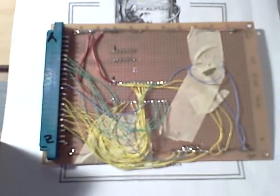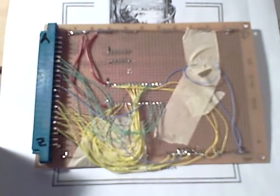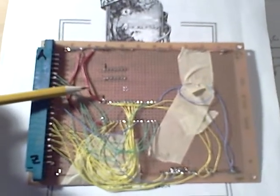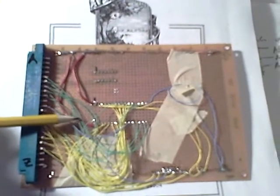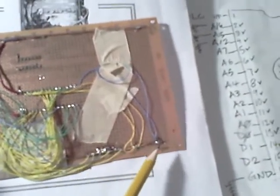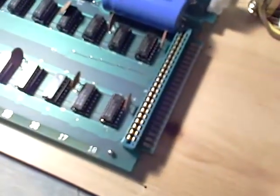On the back, the yellow lines are the address lines and the green lines are the data lines. The red is power. I actually did end up connecting VPP, which is pin 1 right here, and that's normally used to program the chip at a higher voltage, but I went ahead and connected it to 5 volts as well as VCC. The blue wires are ground — this is the ground rail, basically stripped copper wire. The power rail is up here. The cinch connector here is two rows, a top row and a bottom row, 22 pins each, and that's what you have on the Apple One.